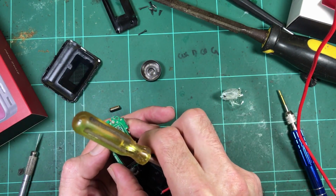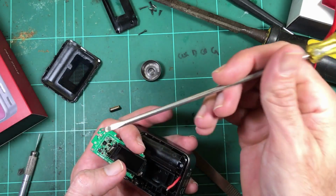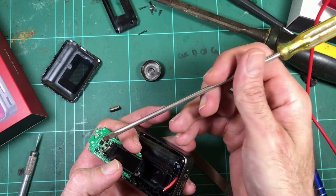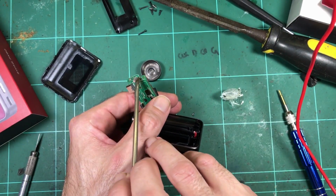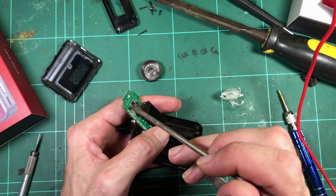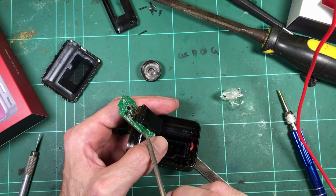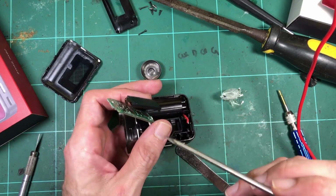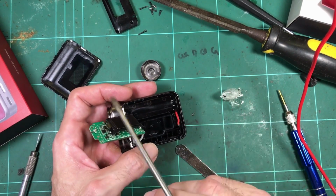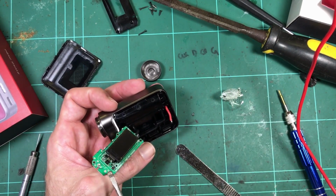It's probably a little standalone. I would say it would be that guy there. Probably the charge controller. And that'd be operating that switch mode conversion circuit for the charging. And it'll be talking to the main microcontroller, which then goes and displays all the battery information, charge level on the screen, and the fact that it's charging.